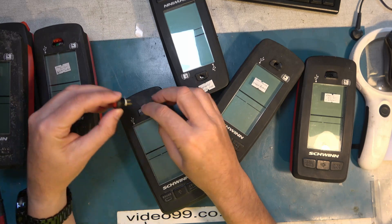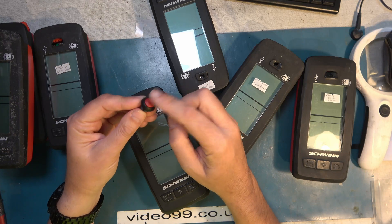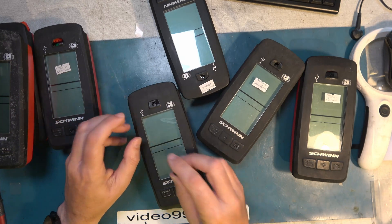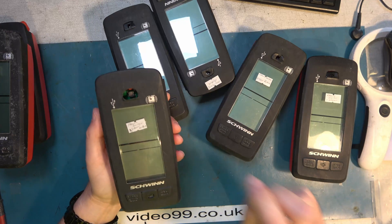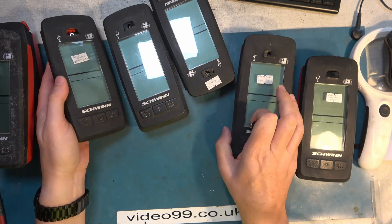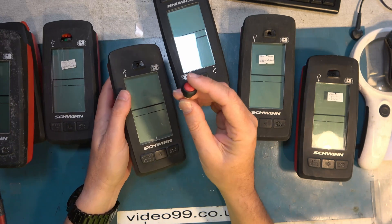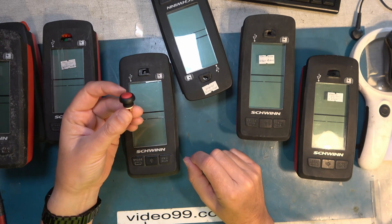We have to bend these tabs out of the way so it doesn't collide with the PCB. The first one I did used a switch from my stock, and these are the same make and general design, so hopefully that will clear the PCB. On some units where the hole is quite large we can do repairs to fill the gap around the switch. I will provide ordering information in the notes below for the switches and a discount code from the supplier I got these from.